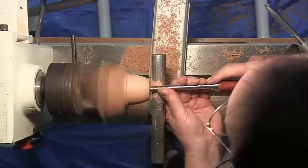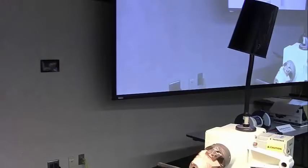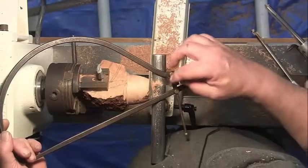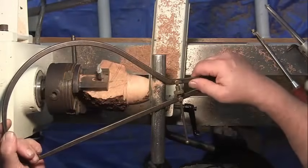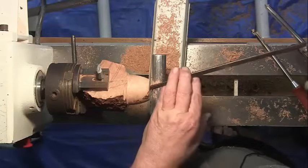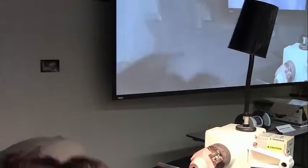One of the things that's interesting about this wood: with a normal piece of wood with grain you can only cut downhill, but with a burl you don't have that problem. Now these calipers are made a little bit different from regular calipers. Most calipers — the spring tries to open it and the screw prevents it from opening, so you can never get past a big thickness to find a small thickness. These are made the opposite: the spring tries to shut it and the screw holds it open. So you can get in past the thick place and find out how thick something actually is. For anybody doing any kind of hollow form, this is the best set of calipers I know of.